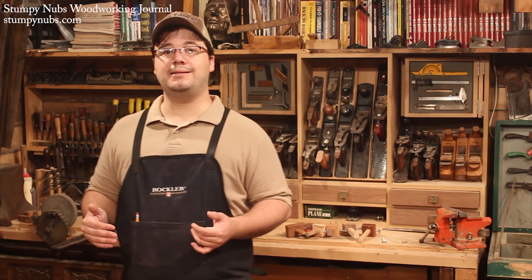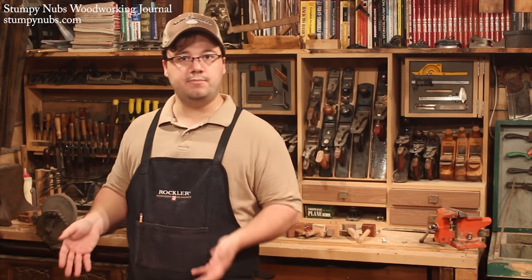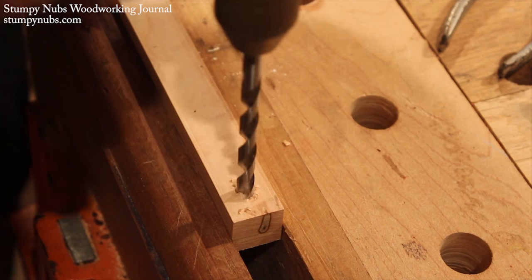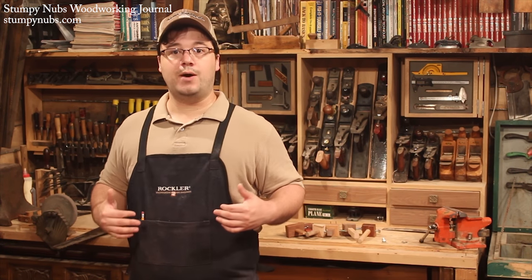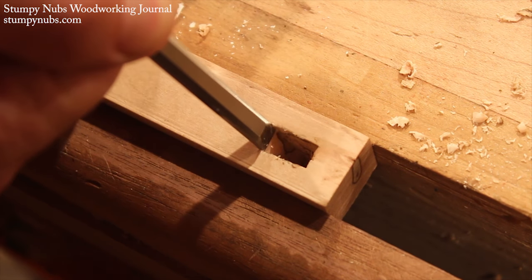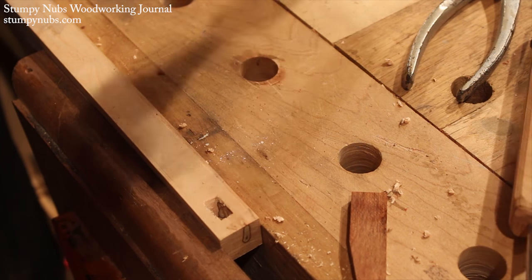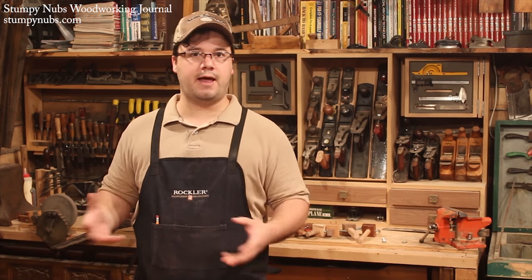The last gauge is a bit more difficult — this one gets a blade instead of a pin. You just want a narrow blade, maybe like a quarter-inch jigsaw blade; that would work out perfectly. You'd have to make a mortise in the end of your beam to hold the blade, so drill a hole about a quarter inch and then square it off on the front end. Stay about a half inch back from the end of the pole so you don't split it out when you drive your wedge in later. Now you've got to elongate that hole so that you can fit a wedge — step back about a quarter inch, maybe three-eighths, and cut at an angle towards the bottom of that hole so that you're only making the top of the hole wider. Pare it away a little bit at a time, take your time, and then make a hardwood wedge to fit into the tapered mortise so you can secure the blade with a tap and a nice friction fit. It requires a little trial and error, but it's really not that big a deal to get the angles to match.